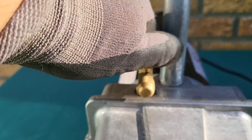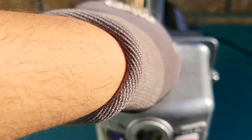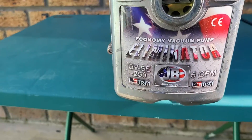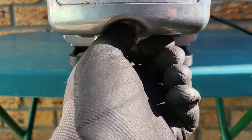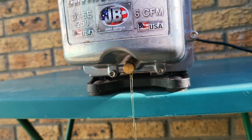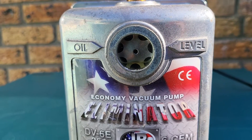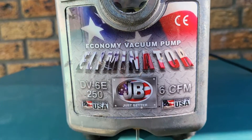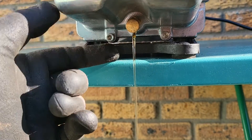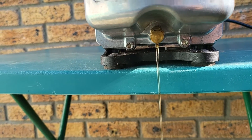What I usually do is open the top port just a little bit as well as the oil port, just to make it easier for the oil to run out as we drain the oil. So we're just going to loosen that and there the oil runs out. An important thing to mention is that the oil plug on this particular vacuum pump doesn't pull all the way out — even if you loosen it all the way, it will come forward but won't drop out completely. It's designed so it just sits there, meaning you have no risk of losing the plug.